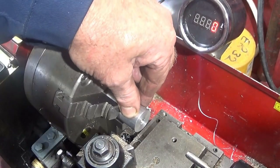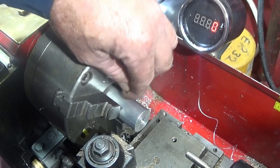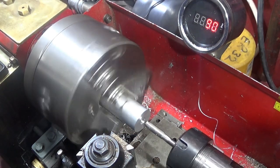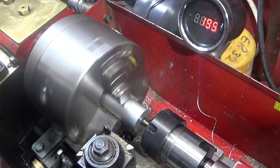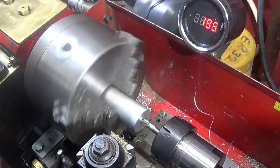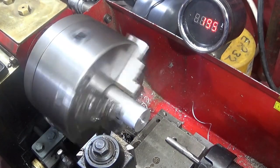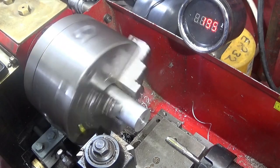So now I'm making the front riser bar. I've done the 6mm thread in the underside, and now I'm doing an 8mm thread as deep as I can get it, so that I can have an adjustment thread on the top. And I'm taking this thread in and out a few times so it doesn't clog up when it's cutting.